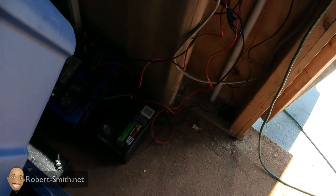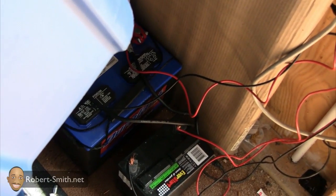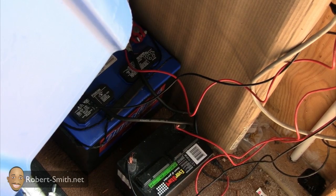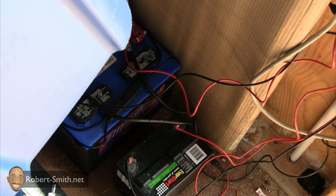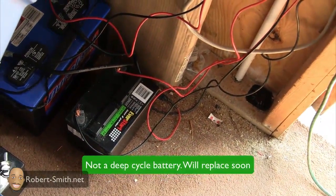On the floor I still have a little work to do. I have one battery — I think it's a 115-amp-hour — the one I used in my first solar panel project. It isn't a true deep cycle; it's like half starter and half deep cycle. I didn't want to throw it out, so I'll use it until it goes dead, but I do need to buy at least another one so my battery charge doesn't drop below 80%.